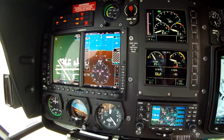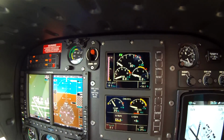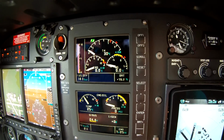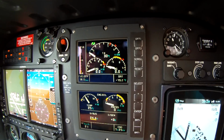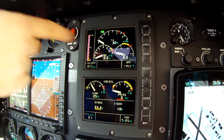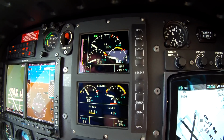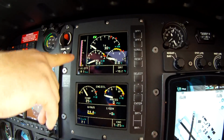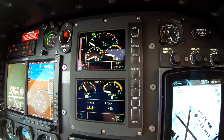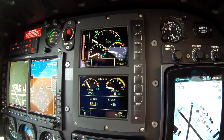As you'll see here, Eurocopter's done a great job of incorporating all the engine and gearbox features into a digital display, better known as the VEMD, Vehicle Engine and Multi-Display. While we're here at idle, it's showing the torque, T4, which is the power turbine, the turbine outlet temperature, and the NG. Once the rotors get spun up, that gauge will go to one big gauge, what we call a FLI, a first limit indicator, and it makes cockpit management very simple to fly.